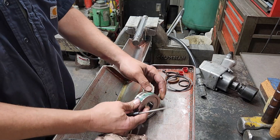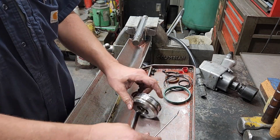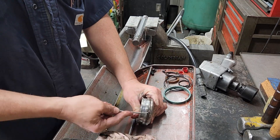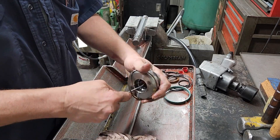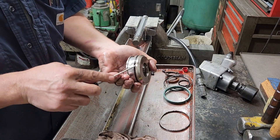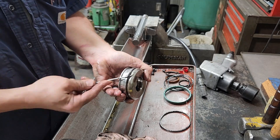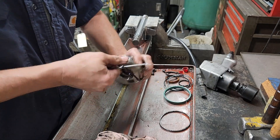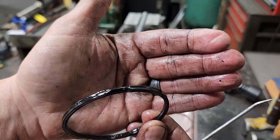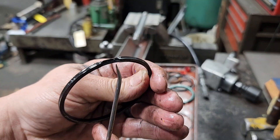Now the piston. Square band, piston seal - there's the seal and the expander. This expander's been blown or something, or it wasn't installed right. It's got a spot on it right here.